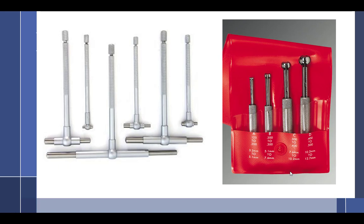In a production shop, I did not use these. I used an inside micrometer, which is actually a micrometer that, if you would take this part off right here and all that's left is what you guys see, it has the carbide tip here and the carbide tip here, and you put it in there and as you unscrew it, it's calibrated to read something. So I would use an inside micrometer and get a perfect measurement. I'm gonna read it, then I'm gonna set up a dial bore gauge.